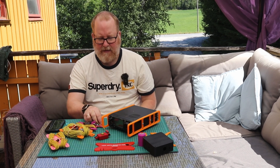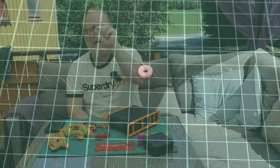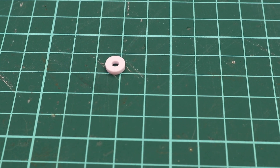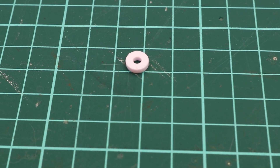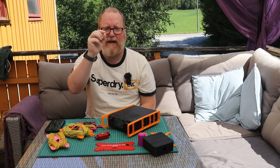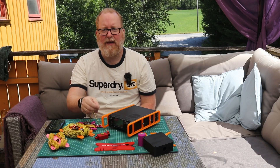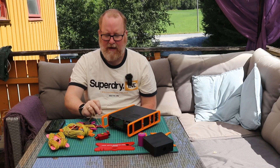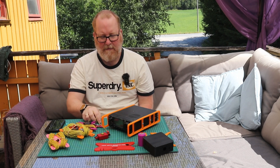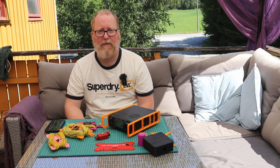This little 8-millimeter circle here is something I needed when fixing some coax the other day. You know, inside those PL connectors you sometimes have a spacer to properly isolate the center and the shield of the coax. My Chinese plugs were missing one of these, so I took three minutes, sketched one up in Fusion 360, and printed it in about 30 seconds. Works like a charm. Easy print solves your ham radio issues.